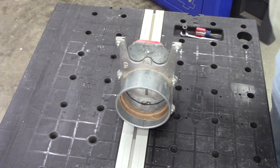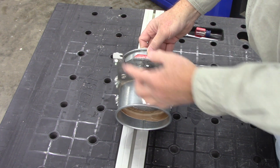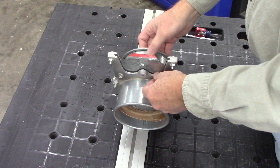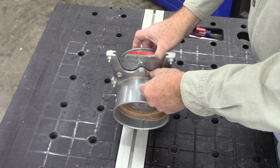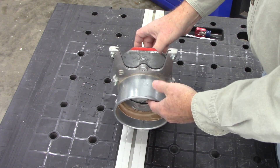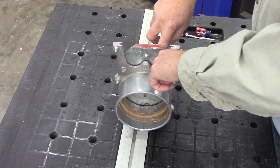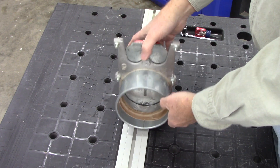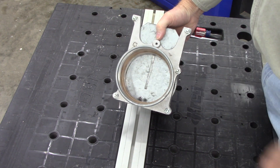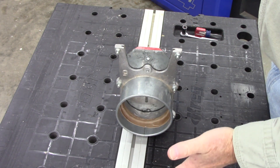The problems with these blast gates - and I don't care what brand it is - the gates will always rattle. There's just an incredible gap in here and it's an air leakage path. It causes the gates to rattle and not seal properly, either allowing outside air in or leakage past the gate. I'm going to address that.